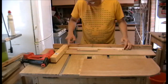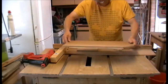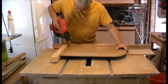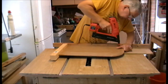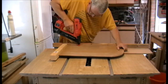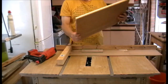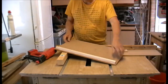And then slotting that in place in the jig so it's right down to the bottom stop. Putting the side on, we need to make sure it's fully up to the 2x2s, and then you can just fasten it with a few nails. And then when we lift it out, you should now be able to see that we've got the 10mm gap that we need for later on.